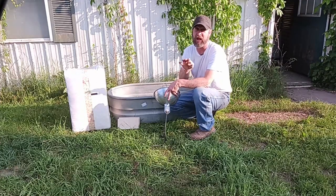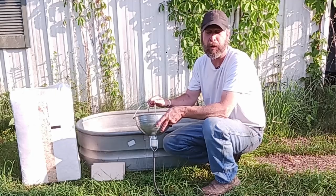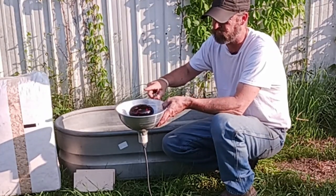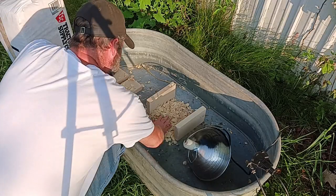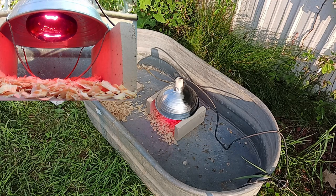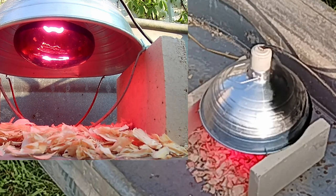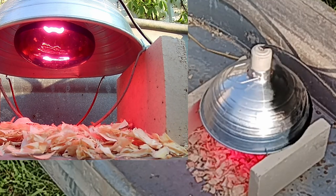Let's take this test to its logical conclusion. We placed the heat lamp with the guard on into the brooder — what you're watching is time-lapsed over about 20 minutes. As you can see, the heat lamp with the guard on resulted in nothing. The guard works — it does what it's supposed to. By keeping that four-inch air gap, it keeps a boundary between the bulb and the bedding that does not get hot enough to combust pine shaving bedding material, regardless of how long it sits there. The max temperature seen below the guard was around 219 degrees, which is well below the auto-ignition temperature.